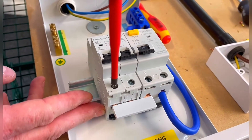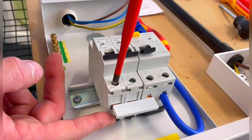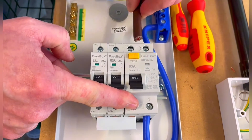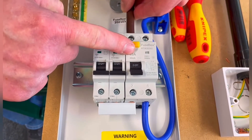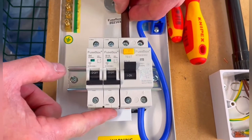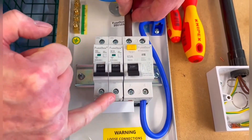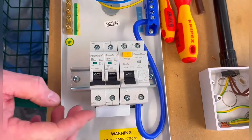Sometimes you have to bend down and have a really good look to check you haven't missed those connections at the base. So these connections under here have caught that bus bar — that's in position. You'll notice the bus bar only goes across the line connection at the top of the RCCB, where the tail or supply cable comes in. The line connection comes in, passes through the RCCB, and livens up the bottom bus bar when energized.